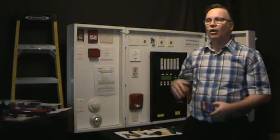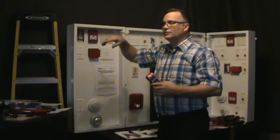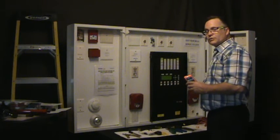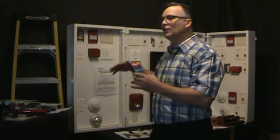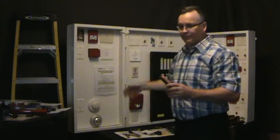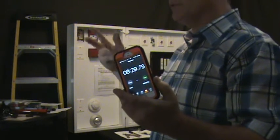Okay, so now, all things considered equal, I'm assuming that wherever this device is in that field, I have to get off my ladder and go do that test. The same thing with the EVS switch. Once I click my switch to the right position, I still have to walk into that field and do that. So that time is equal. You can add that on to every one for doing the isolator test. But as far as getting into the isolators and doing what you have to do, we just spent 8.5 minutes to test your isolators, which is basically for 2 isolators.